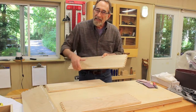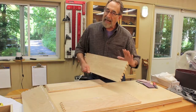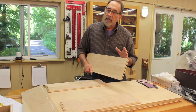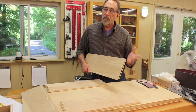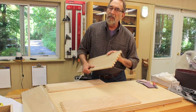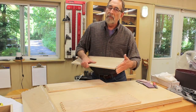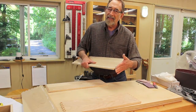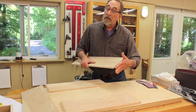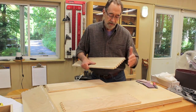I've learned a lot of things about trying to cut box joints in plywood. The idea of ganging these all together with sacrificial boards front and back was a good idea and a time saver. Although, I'm spending a little bit more time cleaning up these joints than I'm used to doing with any kind of jig I've used before for cutting box joints or dovetails.